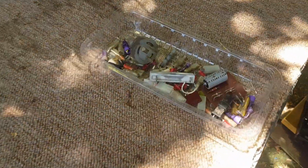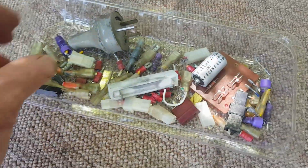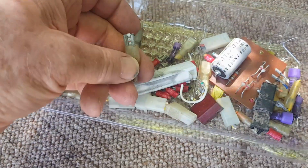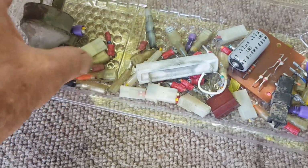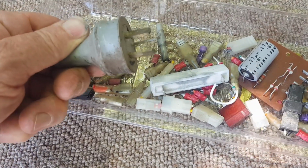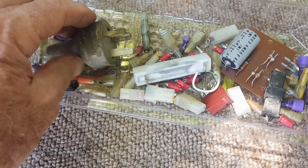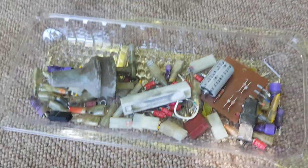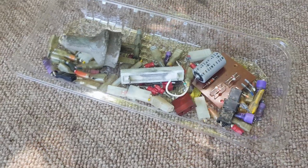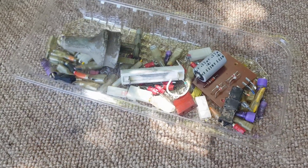All we had left was a little tub of connectors and things. I cut off the wiring looms. These are mostly brass, but they've got contamination. You could throw them in dirty brass. The plugs I don't think can go into it either, or else there's too much plastic in there, but some people pull the pins out of them. I'm not going to allow anything for that, but I'm certainly not going to put it in the bin. It could go to the e-waste bins out at the transfer station if I need to.